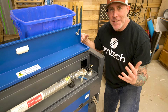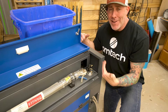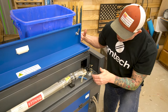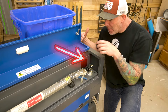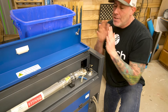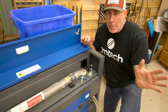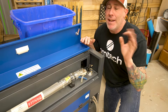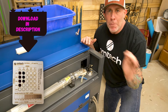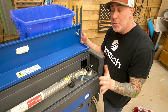Now that your visual inspection of the laser tube is complete and you have this cover open, go ahead and remove this little cloth material — you should have a white little cover going over this mirror right here. You're going to notice there are all kinds of adjustment settings right here. Just be very careful when removing that and don't touch anything. This laser unit should be calibrated from the factory — so this is my first major warning: do not touch or adjust these until you run a test card. Do not make more problems for yourself. Mine was aligned and has been working from day one.